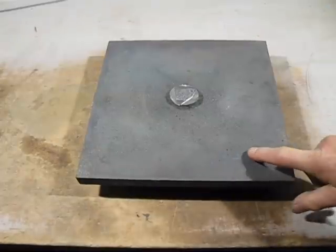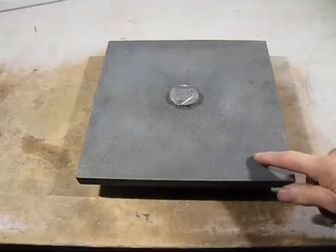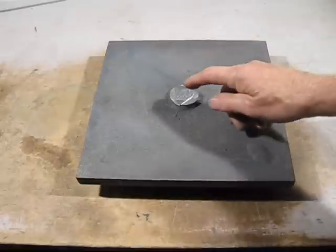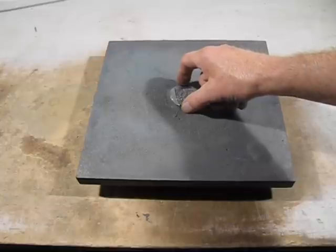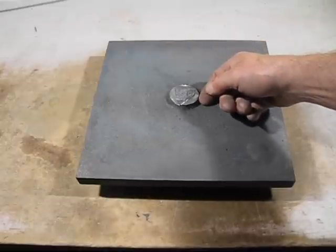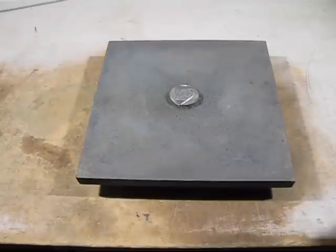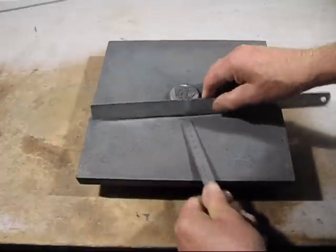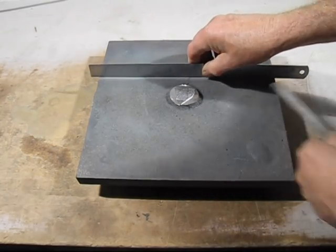Now what I've used as a method here is I pushed my finger into the cope and made a little bit of a bubble in here, so that'll compensate for the shrinkage I did in four places here. But what was a really bad idea, I put a riser in the center. I put radiuses all around the bottom to stop shrinkage and hot spots, but it didn't happen. It caused a massive amount of shrinkage. As you can see, you go around here, around there, and around there.